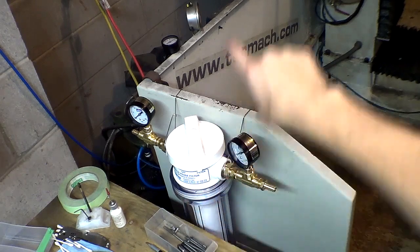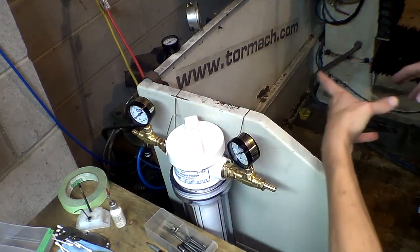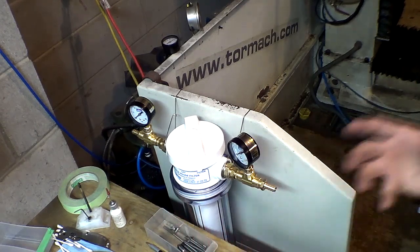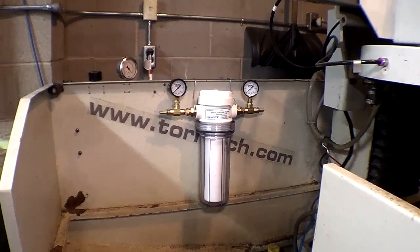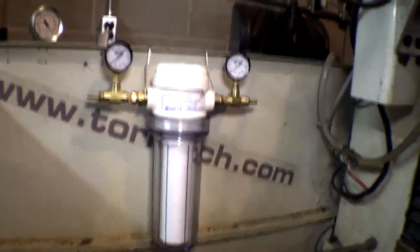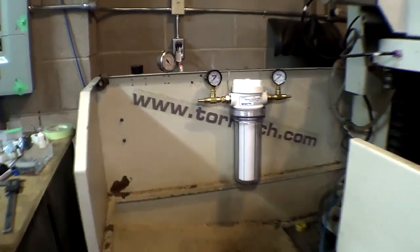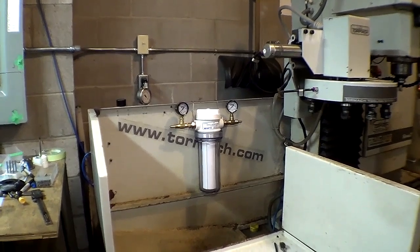I could mount it here on the outside or right here on the inside — but I kind of like the thought of having coolant inside my mill. There's a lot of leak possibilities; the whole thing could have a crack in it and I don't want coolant all over my floor. It's pretty obvious if there's a leak or a pressure differential with the two gauges. My cooling line is right here anyway, so I'll figure it out. That'll probably do it until I get it all plumbed up and turn it on.